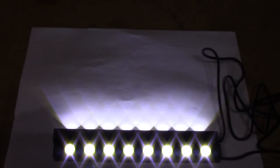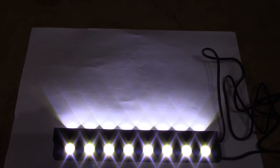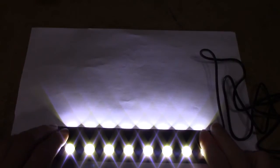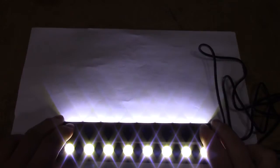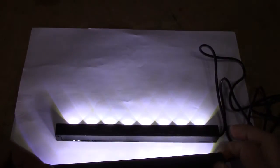The first thing that struck me about these two lights is how very bluish the light is, even compared to my 6500K workshop lights. If this area of the paper is 6500K, this is probably around 8000K or thereabout. So it's not really ideal for being work lights as they were advertised. On the box it says daytime running lights. Not particularly impressed in general, and that does make sense if they actually are new old stock, as the colour of the plastic bag would suggest.